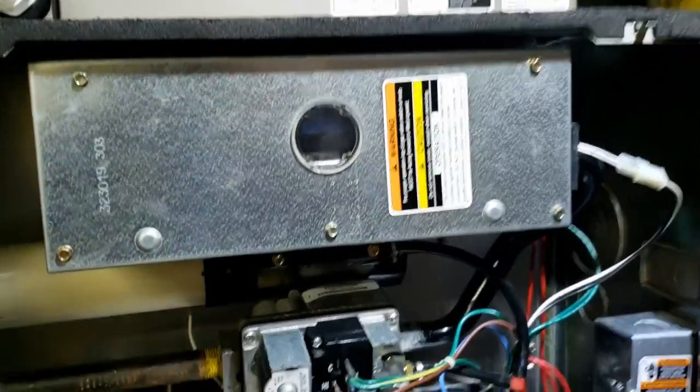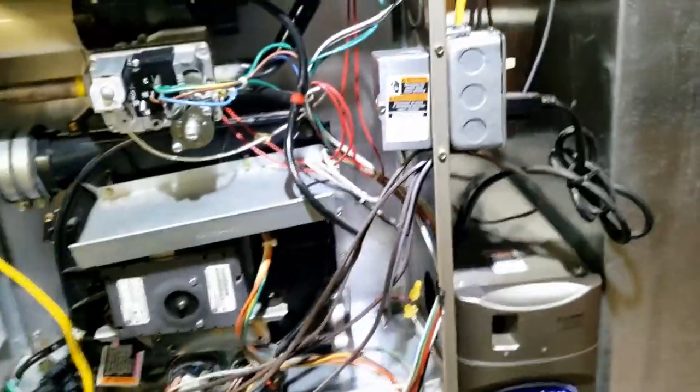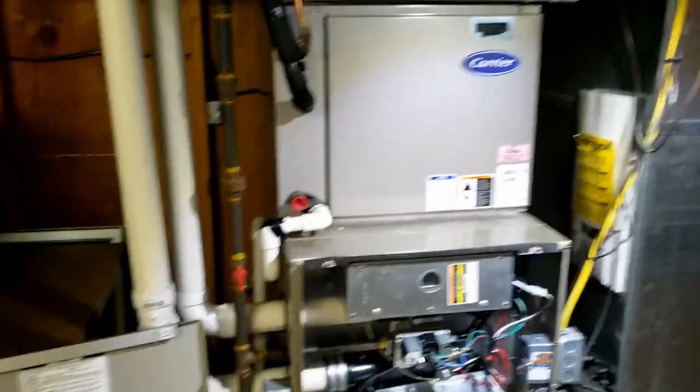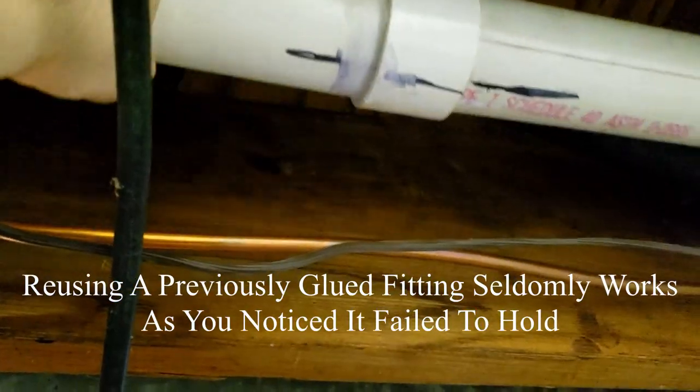Got the cover on there, it's running fine. You can see the flame shooting nice and clear, so it looks good. No rollout on that. I'll clean the flame sensor when we get back. Right now let's go get those parts and start from there. We couldn't leave it like it is. I always want to fix everything - I just don't like it. You can see it comes across, sags down, and goes across. I put the cleaner on there but you can see it's not good.